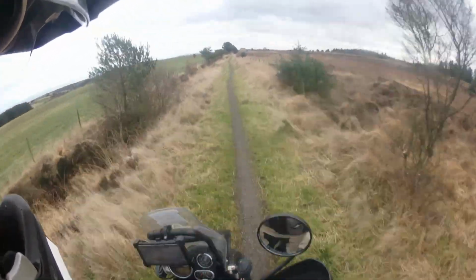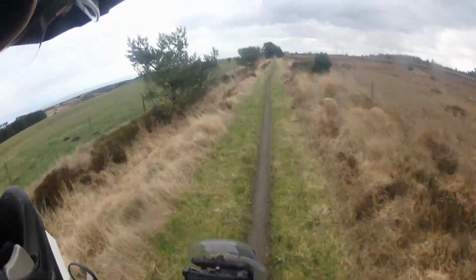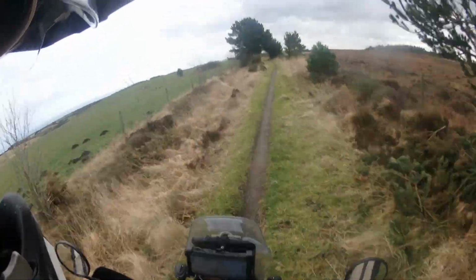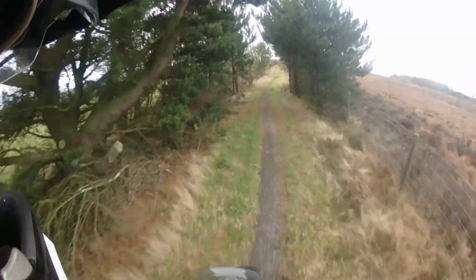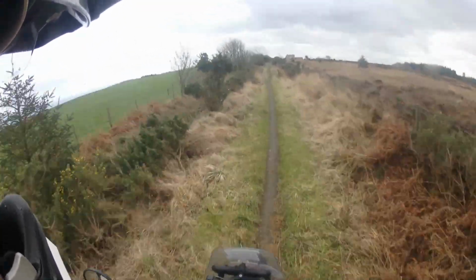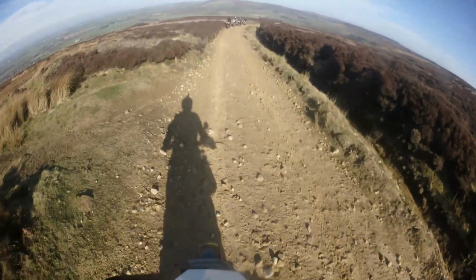Somebody's asked me about the quietness by changing the cam chain. It's made no difference at all, to be honest. The original cam chain and sprocket, if I'm honest, had hardly any wear on it. In comparison with the chain length, there was not a lot of stretch. So it's probably fair to say that this engine could have gone on for at least another 10, if not 20,000 miles before we changed the sprocket.